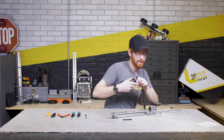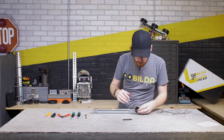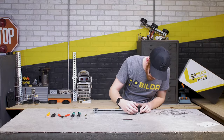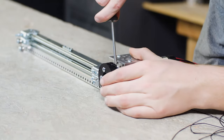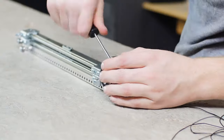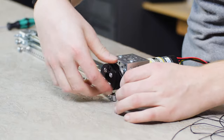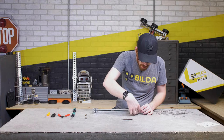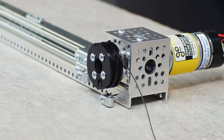The next thing we're going to look at is mounting this pulley to your motor. We'll move the excess cable out of the way and cut that here very shortly. We're going to line up this closer channel of the motor with the V-groove pulleys on the side. Close enough here is totally fine — you're going to have some wiggle room in where your string feeds off anyway. We'll tighten down those pinch bolts on the Sonic Hub. We're now going to add about two wraps to the pulley, just to give us some extra string to work with in the end.